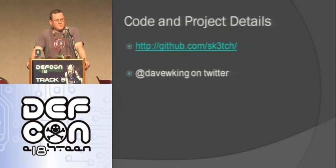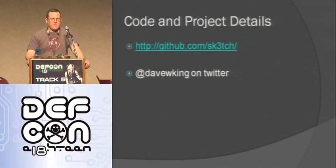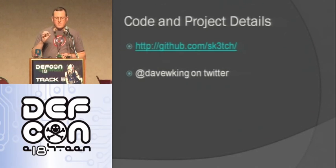Oh, that's a good question. I was going to cover that, but I forgot. I knew that it had to be 160 microhenries. So what I did was I found a calculator online where you put in how big your wrap form is. I measured the toilet paper tube, and it was 2-something inches. Then it asks how big your wire is, so I looked at the gauge of the wire. This wire I just picked up from Radio Shack comes in a pack of 3 different color wires. I used the green. I put it into the calculator, and it told me how many wraps I needed to do, so I wrapped that many. I tried it out, and it wasn't quite working, so I wrapped a couple more, tried it out, and it still wasn't working. It took me about half an hour of messing with a couple more wraps, trying it out, and then it just worked.